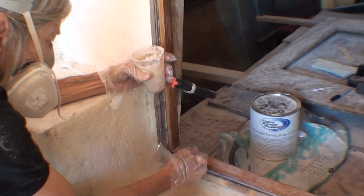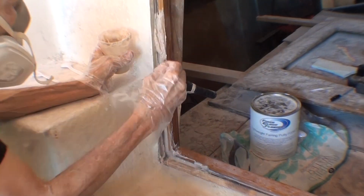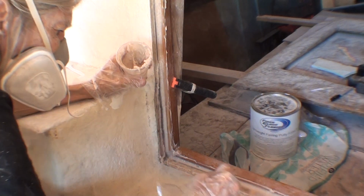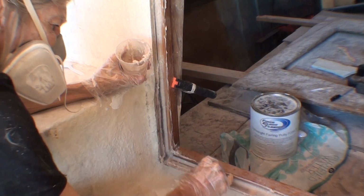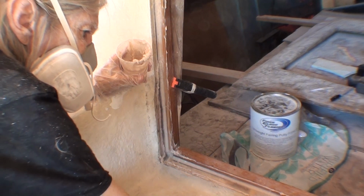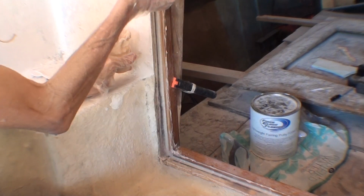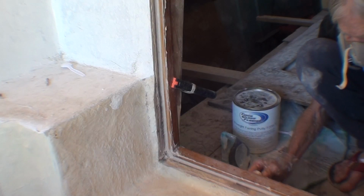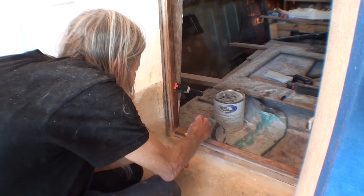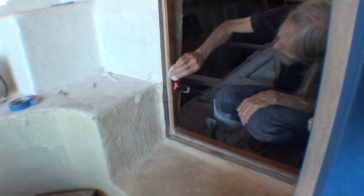I want to fill in that companionway, I don't know, back gouger and round it off somehow. But for now, I'm filling in the crack where I've glued in these boards for the door jamb, I guess, maybe we'll call it. I don't know the right term. So this is just more thickened resin, and now I'm wiping the excess off with some acetone before it fully cures.